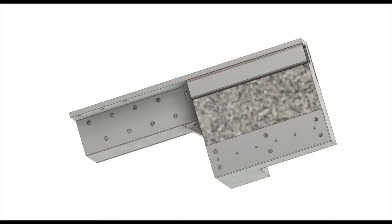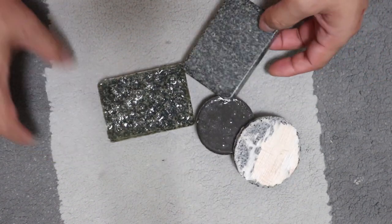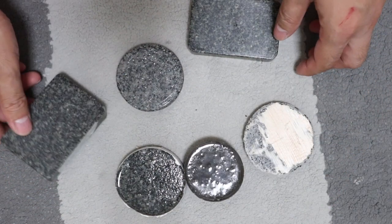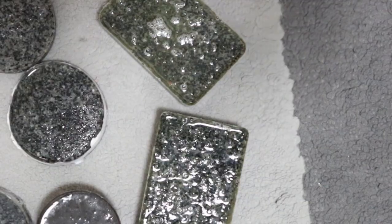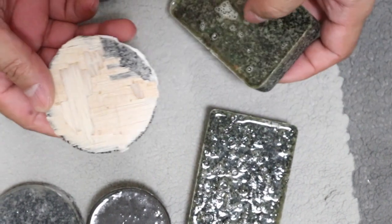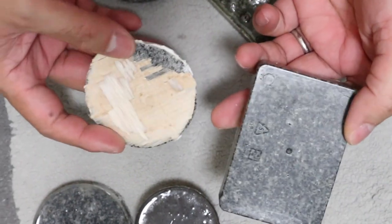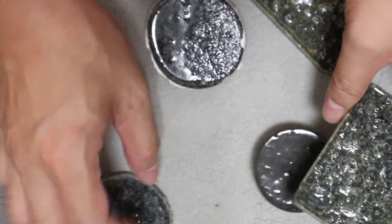So I decided to create the base using epoxy granite. I have been testing and testing for some time now, and have come to the point where I can produce epoxy granite to my satisfaction. Epoxy granite is a very good substitute material for cast bases. Epoxy granite is made from sand, gravel and epoxy, and is about 90% sand and gravel. After the formwork is made, the epoxy granite can be poured to complete the project. If I use this way, it makes possible large and high strength machine bases.